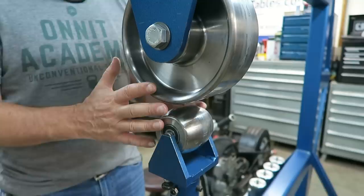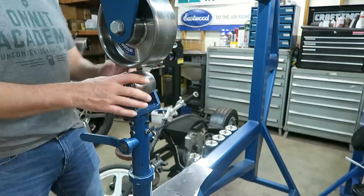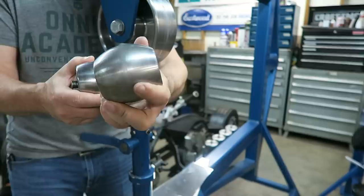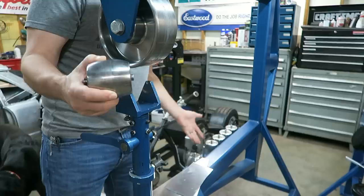How true these wheels roll independent of each other is very important. If there's any deflection or movement, it could affect how the machine rolls. If there's not enough clamping force between the two wheels, you're not going to get the desired performance. Every English wheel has a flat upper wheel and a contoured lower die. You can pop these out and swap them for whatever contour you want — from more aggressive all the way to nearly flat, and everything in between.